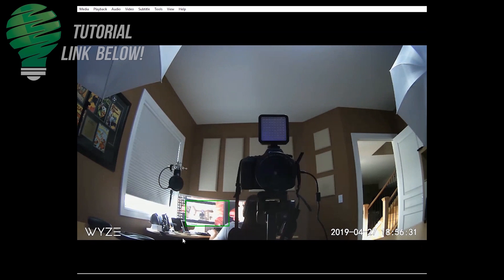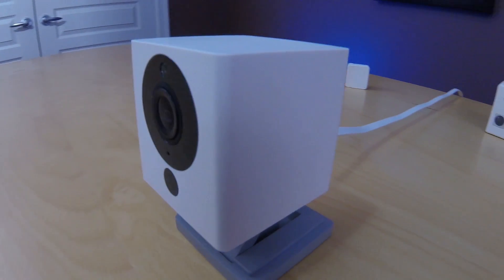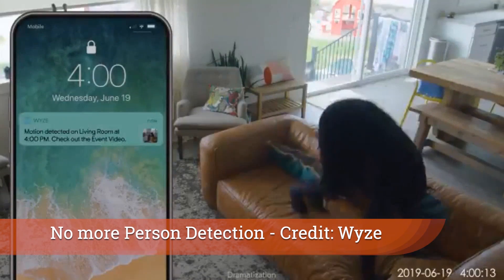RTSP was a really important firmware release that Wyze gave us. I did a tutorial and setup video on that, so I'll leave that link below. RTSP allows you to connect into other systems you might have installed in your home. This can replace a lot of those older camera systems where maybe you just lost one camera and you don't want to lose the whole system — you can install that firmware on these and get them connected into that system. One thing about these specialized firmwares — RTSP and webcam — they're not continuing development on those, and they're not going to bring them back into the main Wyze application. Your cameras essentially leave the application at that point and become part of the other system you're attaching them to.